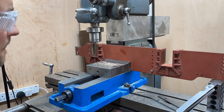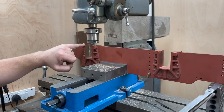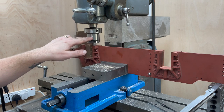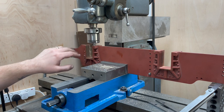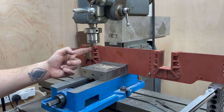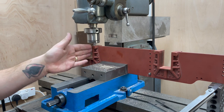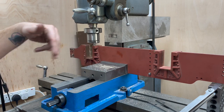That seems to have cut off more at the bottom than the top, but given that we know the top surface here is within five thou or so of being flat relative to the spindle, I think we can say these are probably slotted at an angle rather than that I've done something hilariously wrong. I really like the surface there — that's really nice. I'm going to repeat that on this face and then over on the axle boxes on the other side: touch off, get them flat and parallel with each other, and go down bit by bit.